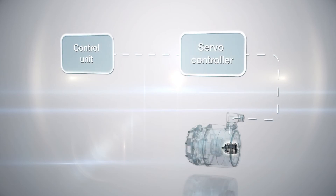In a higher-level machine control, there is a program with specifications for torque, speed, and target position. The servo motor is supplied with electrical current according to these specifications via the servo controller. Feedback from the motor supplies information on position and speed, allowing deviations to the program's specifications to be corrected. This is called servo control.